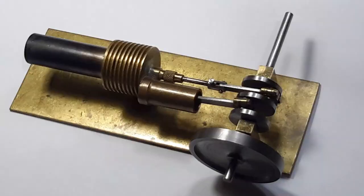It was built with a brass cool end made out of free-cutting brass, and it had a stainless steel hot end with a lightweight brass displacer, and the power piston was mounted on the side of the cool end of the displacer cylinder. And as I stated, the engine would never run because it didn't produce enough power to overcome all the friction of the heavy parts.